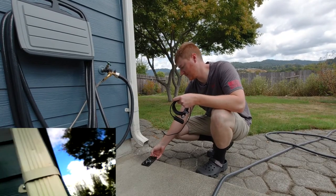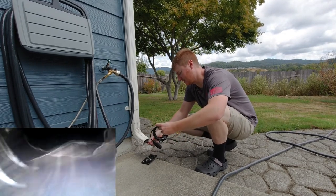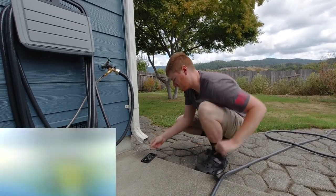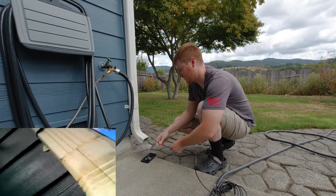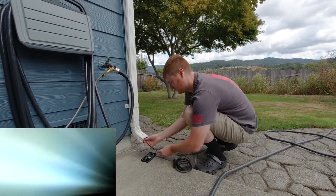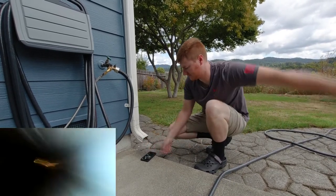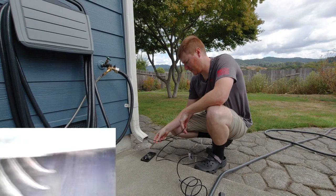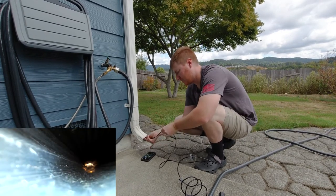Here I'm going to go ahead and take a video and send the camera right up the drain spout here to see what we can see. It seems like it couldn't quite make it all the way up — let me try and straighten it out a little bit as we go. It looks like I was going to be able to make it up about 8 feet or so, which is not bad for going straight up something that's as wide open as a drain pipe.